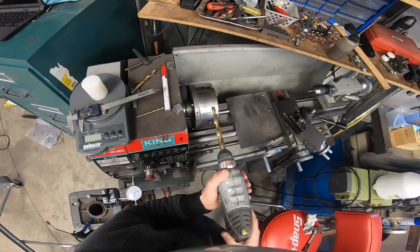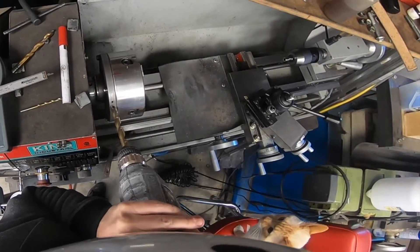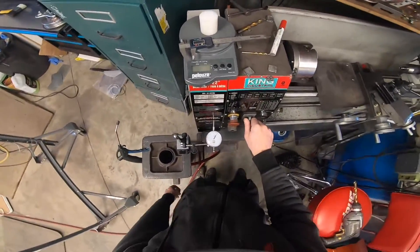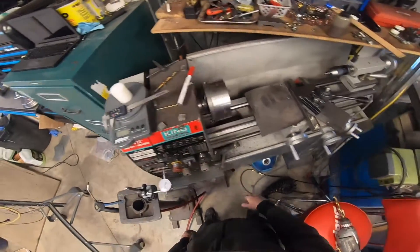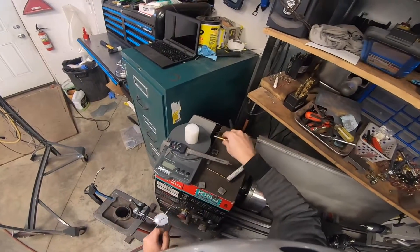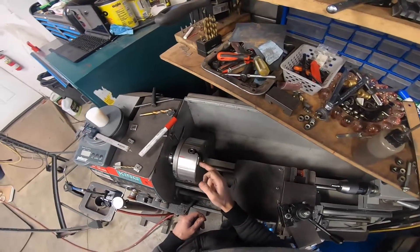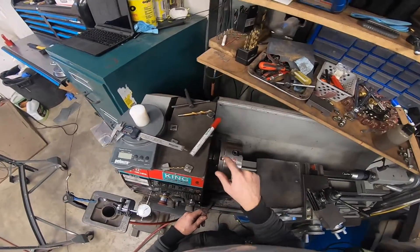I drilled the pilot holes and now I need to drill them out to full size. What I might do eventually is take my milling machine and mill out that whole area. But for now, let's check it and see how close we are to zero. That's thousandths. Let's see if we can get it closer by adding a little bit of weight - we'll sneak up on it with some lighter magnets. I still have one magnet on in the B position, so I'm going to have to come back and drill a couple more holes there.